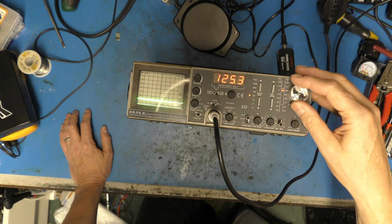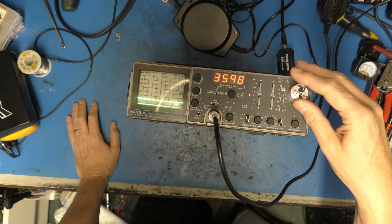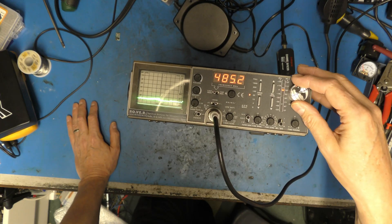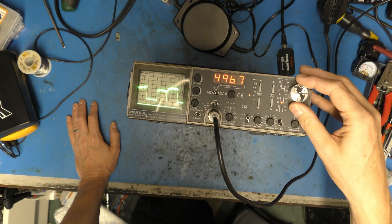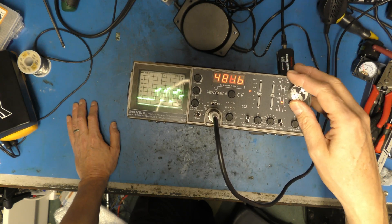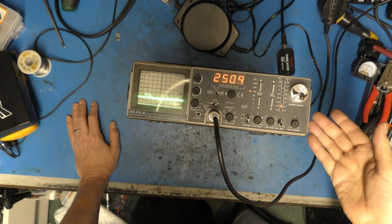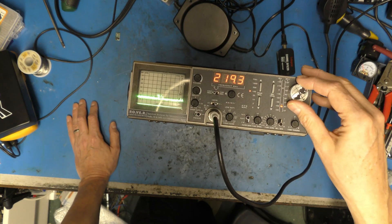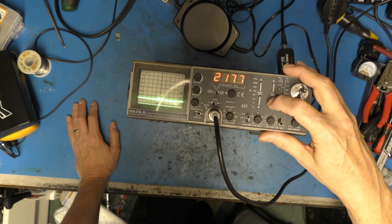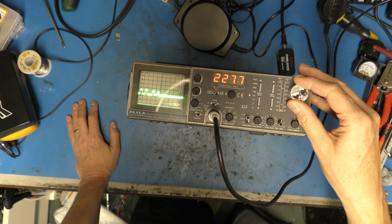So that's what it's doing — much like an oscilloscope plots voltage over time, this is plotting signal strength in decibels against frequency. Useful instrument. I had to use it the other day because the local centre for adult refreshment currently has no television reception, and would I mind taking a look? We can actually see the individual multiplexes now because I've changed the receiver bandwidth. If we go down to 200 megahertz, these little peaks here are, in fact, digital radio broadcasting here in the UK — DAB.